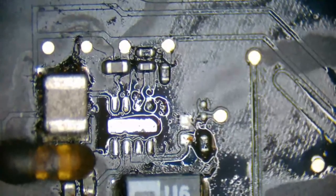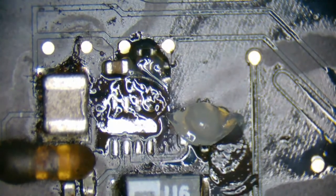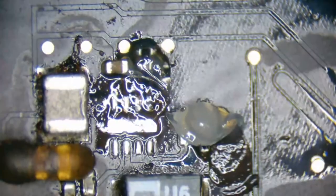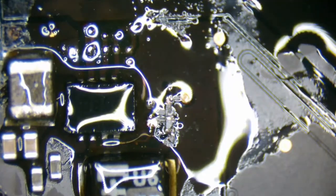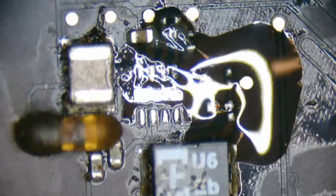Right, let's go back to our donor board and just start pulling off some components. So I'm going to switch over to my tweezers now. And let me get my small tweezers, my Dumont tweezers. Shaky hand. All right, so what I'm gonna do is just gently put the components roughly on their pads, and then I'll heat everything up with the rework station to get it aligned. My hands are just way too shaky right now.